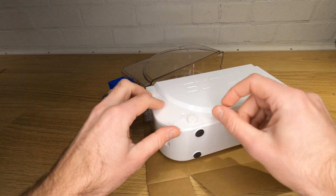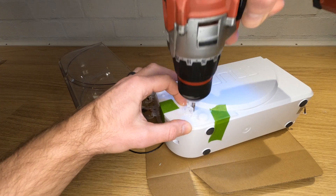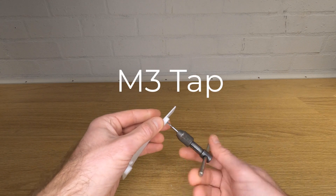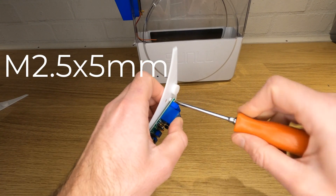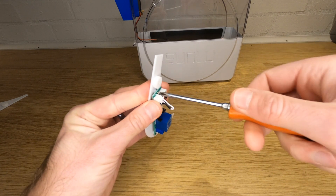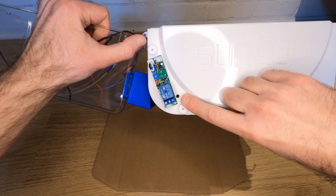If you're adding the relay things get a little more involved. First print off the left hand side plate — this should line up with the rear section of the base. Tape it in place and drill through the 5mm hole. Remove the plate and tap out the holes for the cover bolts with an M3 tap. Fit the relay with M2.5 by 5mm screws. I just ran the screws through a few times until they cut their own threads. Then use double-sided tape to attach the plate to the side of the base, making sure the holes are lined up.